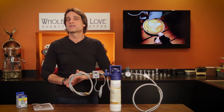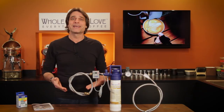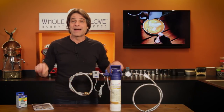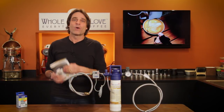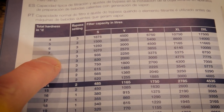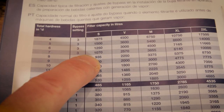Now if your test gave you hardness results in degrees, you're ready to go to the chart that came with your filter and find the bypass setting. If your results came in parts per million or milligrams per liter, no problem — it's easily convertible to degrees using the online calculator linked in the description. Or if you're good with the math, just divide parts per million by 17.8 to get hardness in German degrees. So if your hardness is say 125 parts per million, divide 125 by 17.8 and you get 7.02. With that information, we can go to the chart. My source water hardness is 7 degrees, so my bypass setting is 3. I'm using the S-size filter, so I can also reference my filter capacity which is 1,070 liters based on my source water hardness.